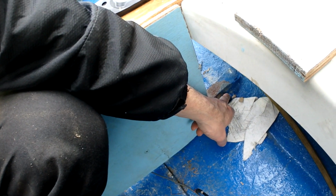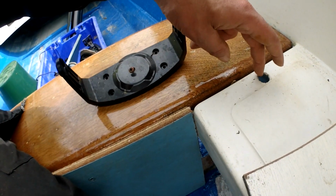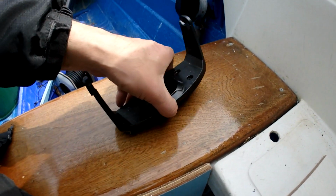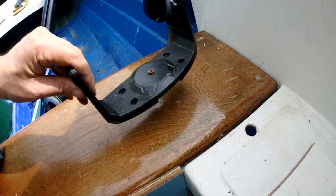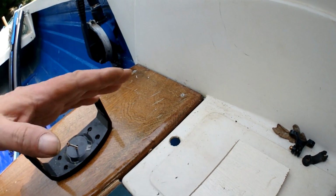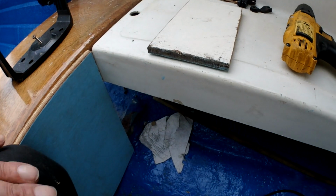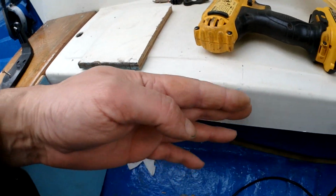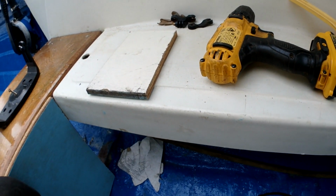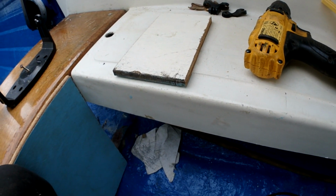because this way the pole can come down attached to this bar. We'll put a bracket or a block on there, make this hole bigger so it slots in. We're going to put some wood under there to reinforce it a bit, and then we're going to be building a box here for the sounder, for this and the GPS. So we'll have a box here, and where the box comes up here, we'll bolt the pole to the back of the box. That solves the issue with the pole, so that should be pretty sturdy. And then we're thinking at the moment for rod holders to come down here, so we'll put rod holders there, so they'll come up from the side of this seat, out of the way again, because obviously you've got the winch on the right, and everything when fishing is always working on the right most of the time. And that's where we are at the moment.